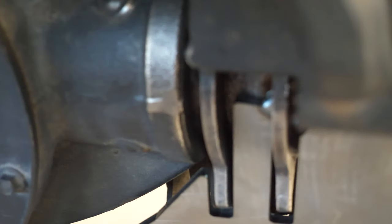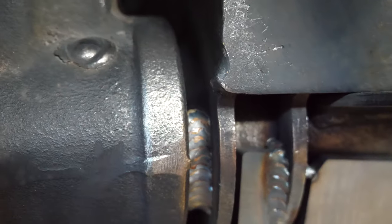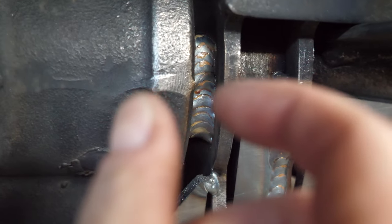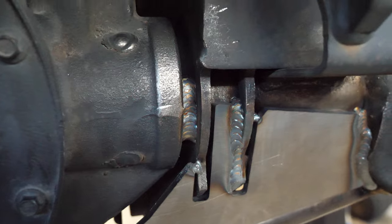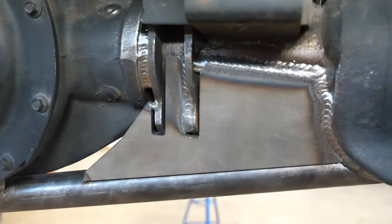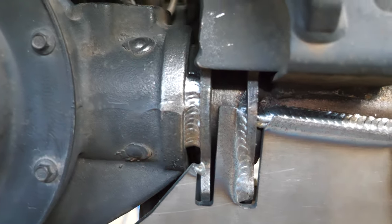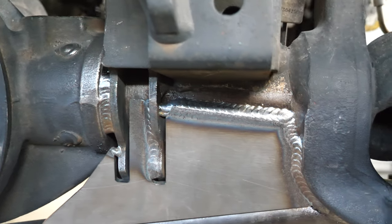Casey's filling this gap right here — basically filling between those two plates so the cast and that plate can't compress towards each other on a hard hit. It's just a little extra security and worth trying to fill in there as much as you can, building that up over a few passes. Casey's midway through, bouncing around, filling gaps. We got that little block between the plate and the cast diff filled up, and we're peening everything to take stress out of the weld as we go.